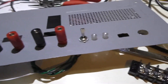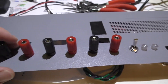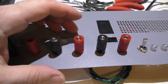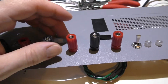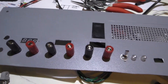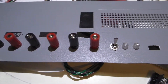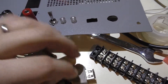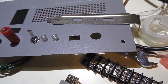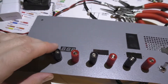One of the other things I was thinking about is that since this doesn't put out the highest amperage on that standby 5 volt tap, I might put another slot up here and put a secondary USB off of these two terminals — that'll give you another place to plug a USB device in, but that's also going to be a higher output. I might current-limit it; I've got to figure out how to do that, maybe some kind of a resistor, maybe an LM317 current limiting circuit. I gotta figure that one out and figure out how I'm going to get it mounted. I'm going to use this as a template — place it over, mark the holes, drill that out.